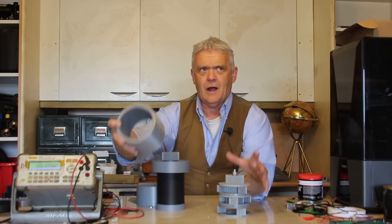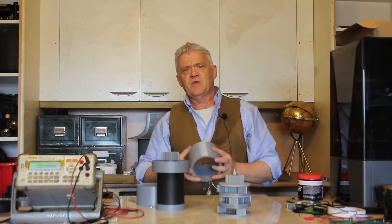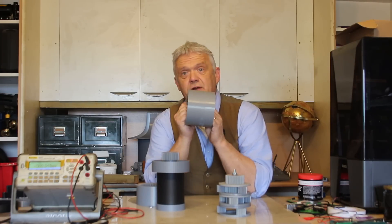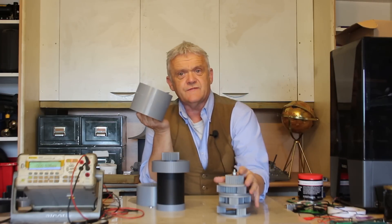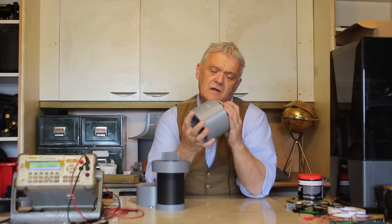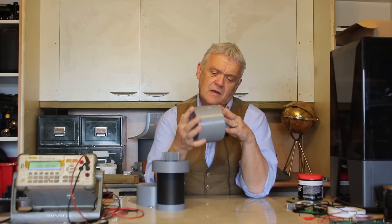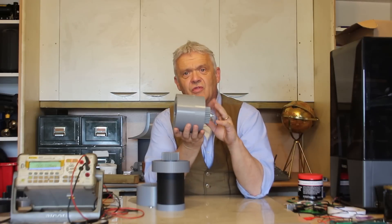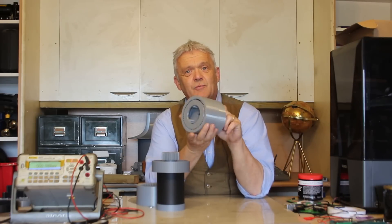The bearing is 8mm center. The other thing we've got is the actual ring gear itself — again, these are available in that file. I've done this for three of them and those three just slot in there. If I turn that I'll get 27 times the output.